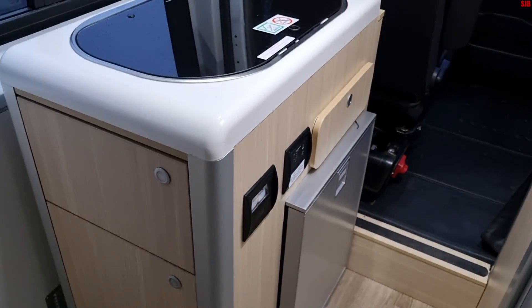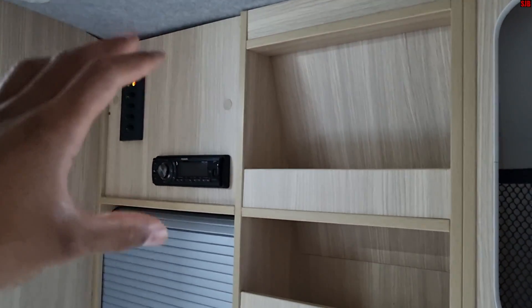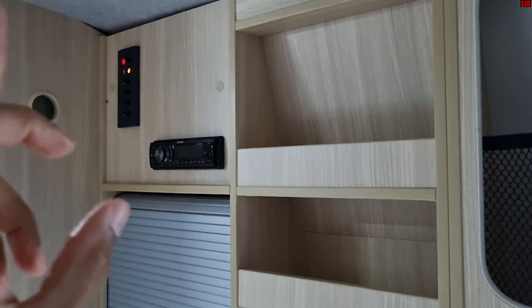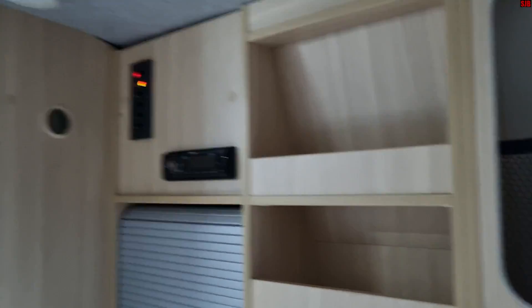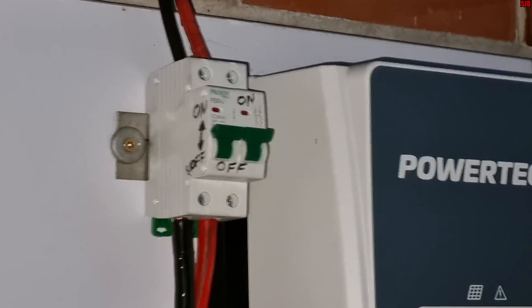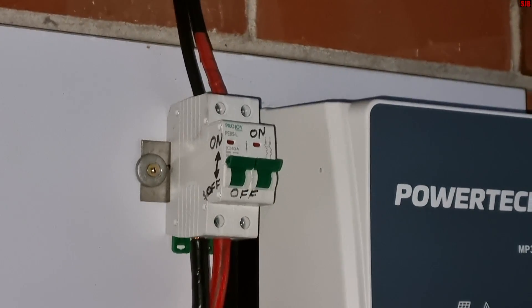This is why it's always good to check your solar panels and important to do an annual check to make sure all the electrics are operating properly — this vehicle was assumed to be charging but it wasn't. As a rule of thumb, if you're running anything larger than about 300W and above you want a circuit breaker or fuse. At the moment this is only a 100W panel so it's fine to run straight to the controller, but once you get above 250W you'd want to fuse the circuit or use a DC circuit breaker. As an example here is a larger 60A charge controller paired with a DC circuit breaker — that's the sort of setup you want above 250W.